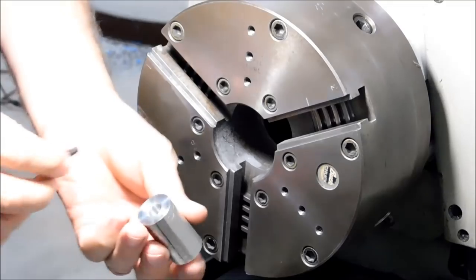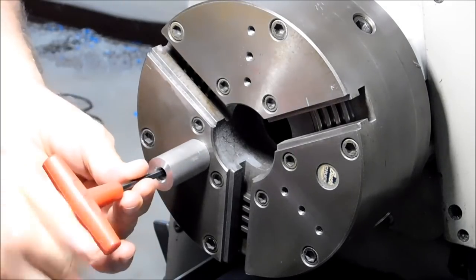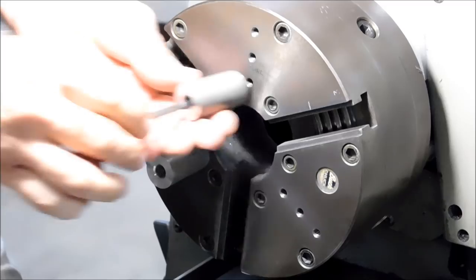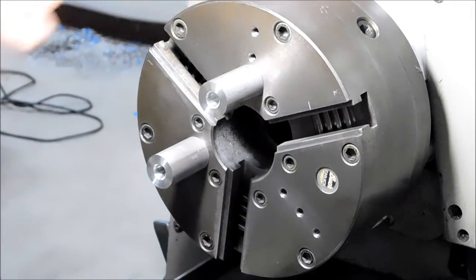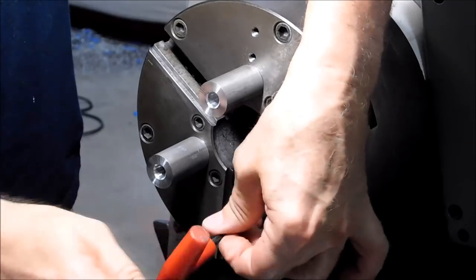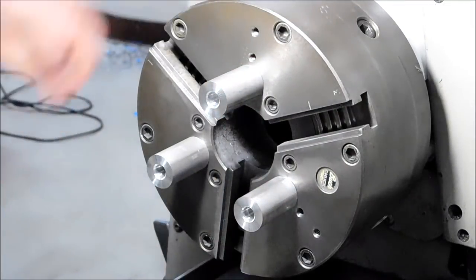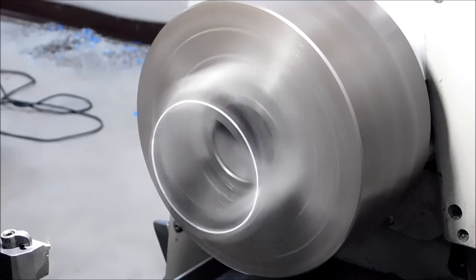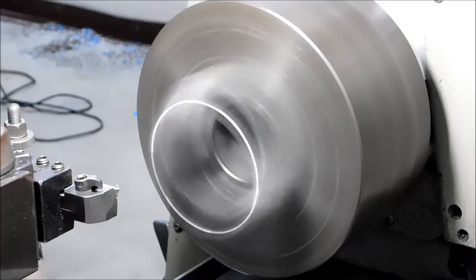Here's where the holes come into play. One inch diameter bushings — I'm going to screw them right to the face of the chuck. If you've watched some of my other videos about jaw movement that you probably weren't aware of, you've got to see the advantage to having a solid standoff right on the face of your chuck. No matter how tight you squeeze on that part, these aren't going anywhere, because they are connected right to the face of the chuck.